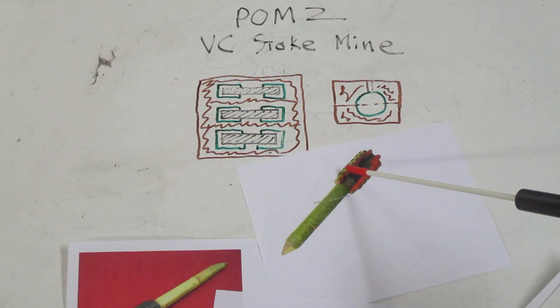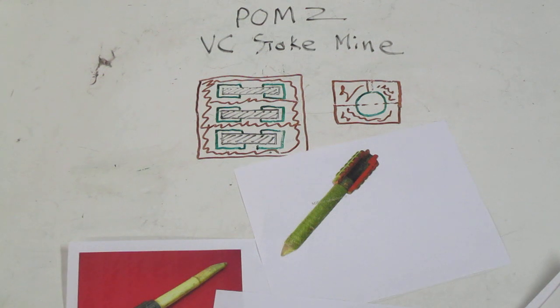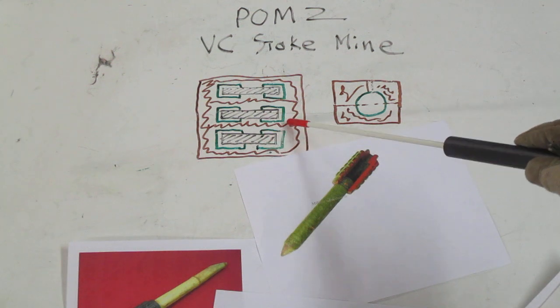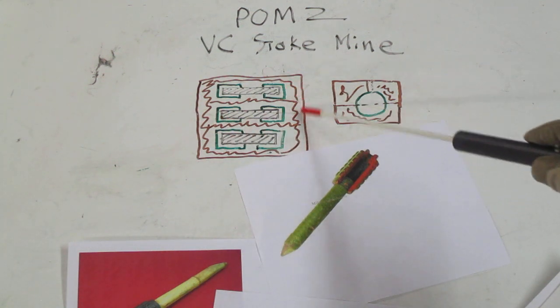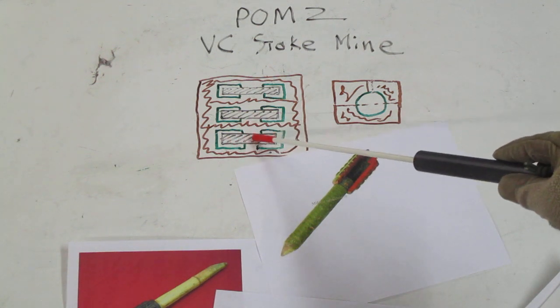I highly suspect that these cast iron casings were manufactured in the bigger cities, not out in the country, not out in the jungles, because of what you would have to do to make that cavity. Now, from what I've seen on the one video on making the cavities, the material used to make those cores is the same as the material that the mold is made from. So if you're using a sand mold, you're using a sand core.